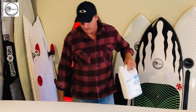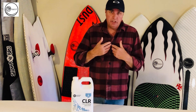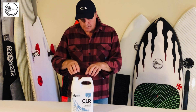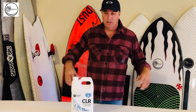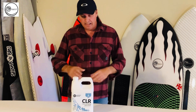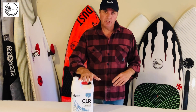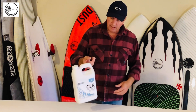One of the reasons I like working with epoxy is that personally when I'm laminating with epoxy, it is better for my health - it releases less fumes. In some of my videos you would have seen me doing a gloss coat without wearing a mask. Had that been traditional polyester I would have had to wear a mask because of all the fumes coming off. This stuff is better for me, better if I get it on my skin, better when I sand it. When you sand fiberglass you're always going to get fiber, so that's not good, but the actual epoxy is fine when it comes to sanding - it doesn't get into your lungs as much.